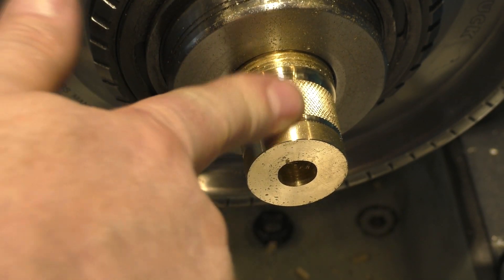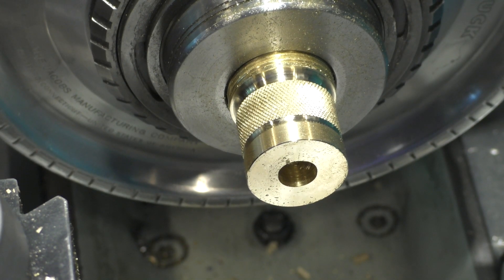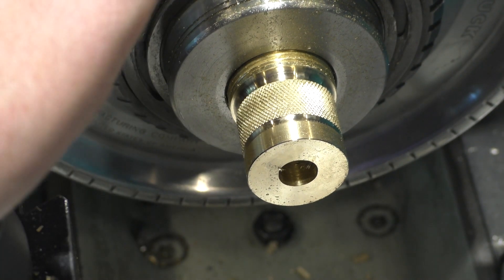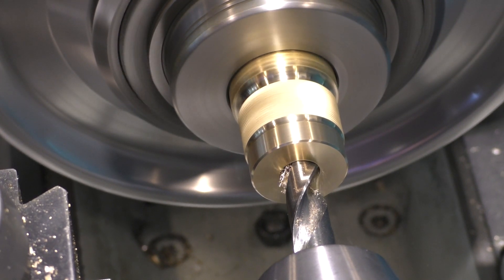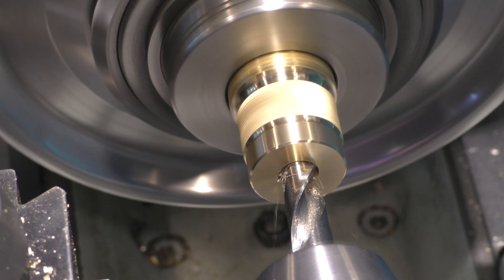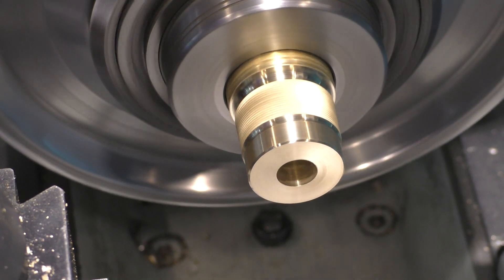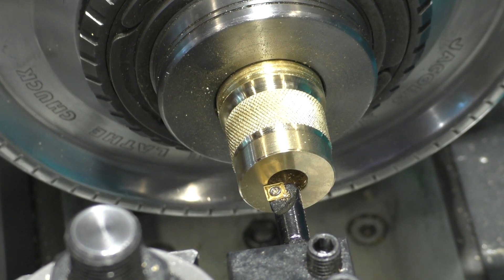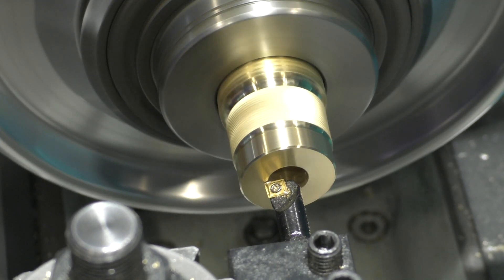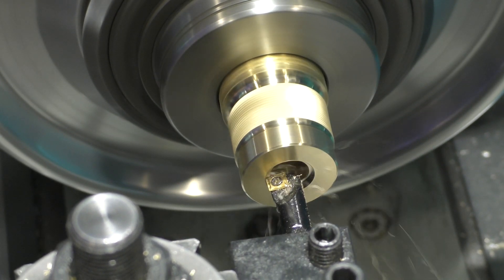I went in on two spots to make it nice and smooth. The knurling gives you a really good grip. Next up we're going to drill out the center and bore it. We keyed out a starter hole, and now we can open it up with a boring bar. I don't have the right tap size drill - I need to open this hole up by about 150 thousandths, so the first pass we'll go for 100 thousandths. This brass just cuts so wonderfully.